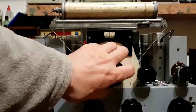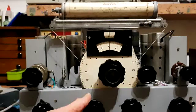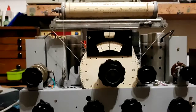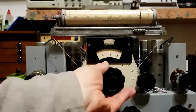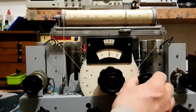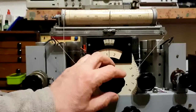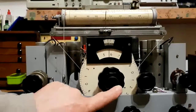Now I've gone up to 160 kilohertz there. Right, that's band 1, range 1. Change over to range 2, which runs from 160 kilohertz to 500 or 450, I think. So this is basically the long wave on the old radios. I'll just peek around the area. Around about 250 kilohertz, not sure what the signal is. A lot of fading on that one. 230 kilohertz-ish.